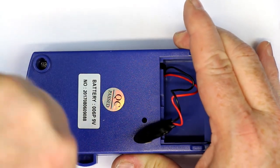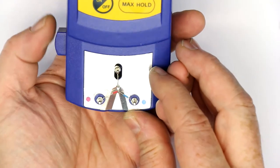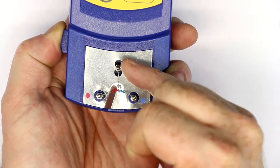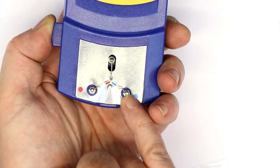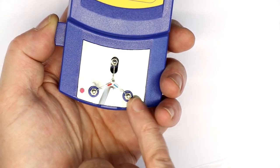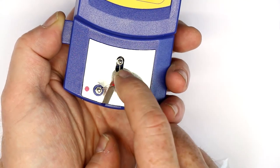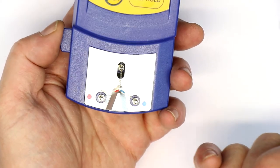So put in a, by the way, what I forgot to show you. To replace the sensor, you have a little knob on the side which moves the center pin here inward, so you can easily put first the two outer contacts into the outer pins, and then put the center pin, or the little wire loop, into the center pin. So that's a nice idea.